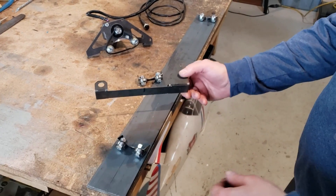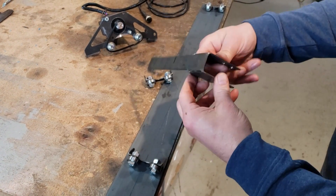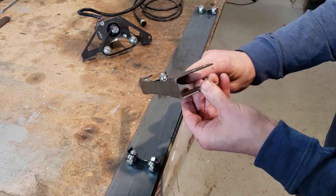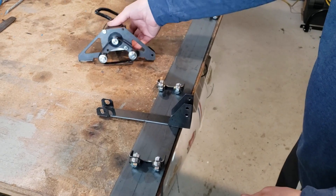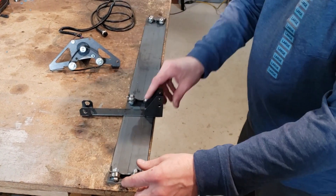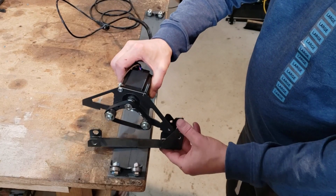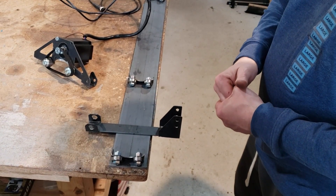We've got the pieces — you saw them get plasma cut. We did put bend lines on them and were able to take them around the edge of the table and bend them. Because we only left three-sixteenths of metal here, we'll put a spot weld on each side to hold them firm. We've got the pieces bent up, the motor mount bent up. We marked a centerline down this piece of 30-inch flat bar and we're going to put the bearings on the centerline. We've made a mark where this pivot needs to be, so we'll get that welded on.